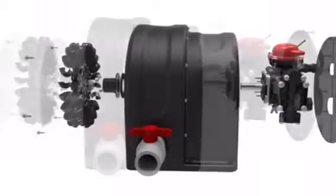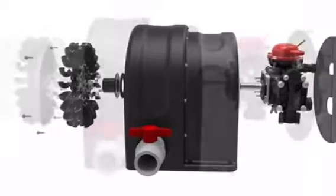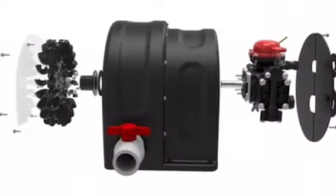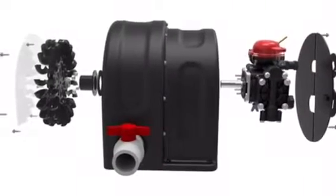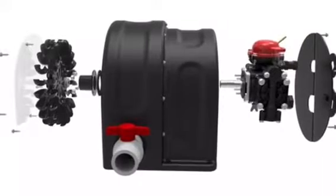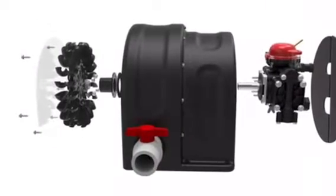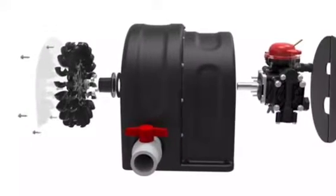The options of this pump: it runs quiet. You don't have that constant bang of a ram pump. It uses plastic penstock, which is the pipe that supplies the water to the pump. You don't have to use steel pipe. It can meander down alongside the riverbank. It doesn't have to be kept in as straight a line as possible. No need for a heavy concrete foundation. This thing can pump from a small stream with a heavy silt burden, suspended grit particles, without the need of a settling tank, as long as it goes through the jets and powers the wheel. Same thing as the generating units: if you need more water, you can just add 1 or 2 more of these pumps.